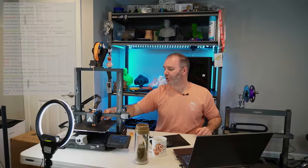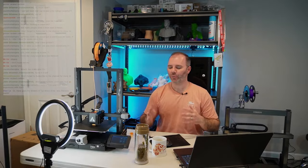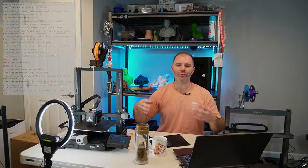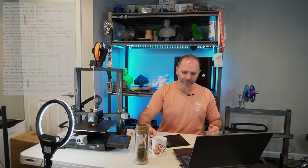We're making a PL3D cube. If you don't know, get one. PrisLeo3D.com. Joking. Running Marlin right now. The real whole thing of this is we want to put Klipper on this thing. I don't know that it can be done. We dissected their Marlin firmware. We found out it was using the board pins for an MKS Robin Nano Pro. Robin Nano. So we're just going to flash this like that's what it is, and we're going to use those board pins. So let's figure it out.